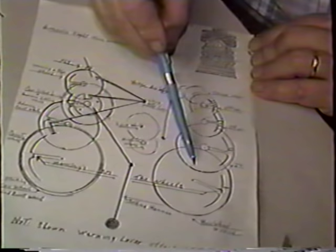By learning the nomenclature and the functions of the wheels, when you have to troubleshoot a job and something doesn't work the way it's supposed to work, you know exactly where to look. For instance, if the time train has no power in it, we're going to look in the wheels and in the pinions and in the teeth to see if we have a bent tooth or a broken tooth, something that's jamming up that train